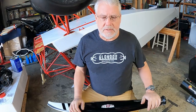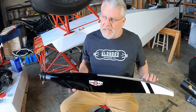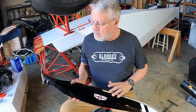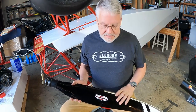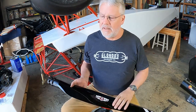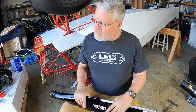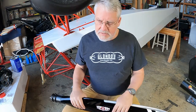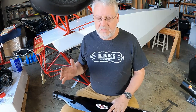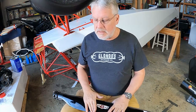All right, and where I typically like to show the stuff I just received, of course I just showed you the T3 tailwheel. My engine importer, Brett Hahn, talked me into ordering a Sensenich ground adjustable prop. This is a hollow carbon fiber blade. These blades are heavier than the Megalyn prop I have, which may be similar or identical to the NR Luga, what's the other name, Cool Props. But I'm not certain about that, so it doesn't matter. Anyway, that prop is spectacular workmanship, super lightweight. Even though the blades are heavier, there's only two blades in this case instead of three.